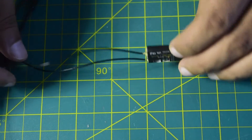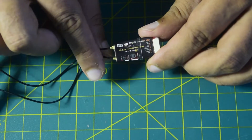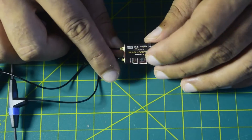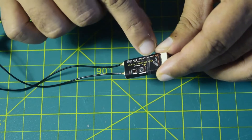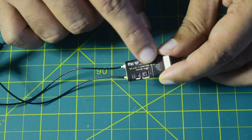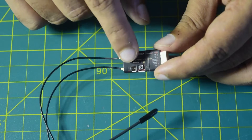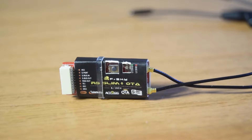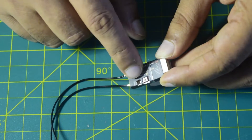This is your radio receiver module — the FrSky R9 Slim Plus OTA. This is a 900 megahertz long range radio receiver which will give you more than 10 kilometers of range depending upon interference in your area. It supports FrSky ACCESS protocol, telemetry, and OTA firmware upgrades, meaning you can wirelessly flash firmware onto the radio receiver to match the firmware on your transmitter.